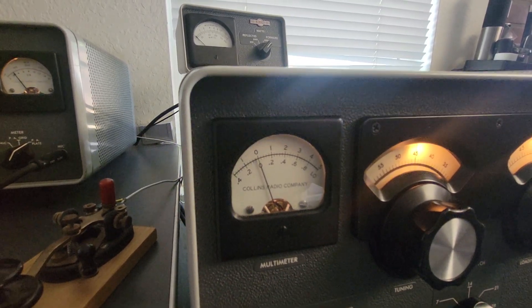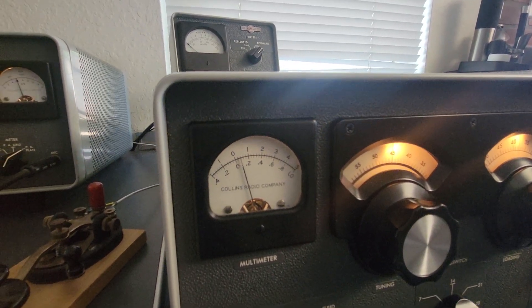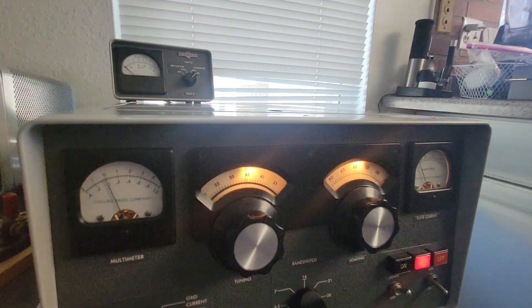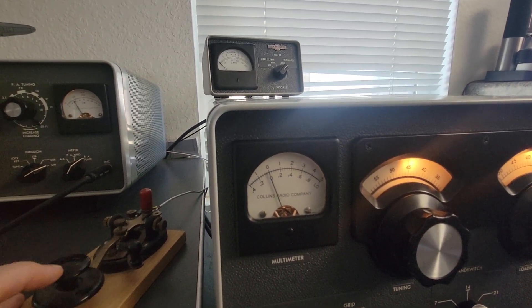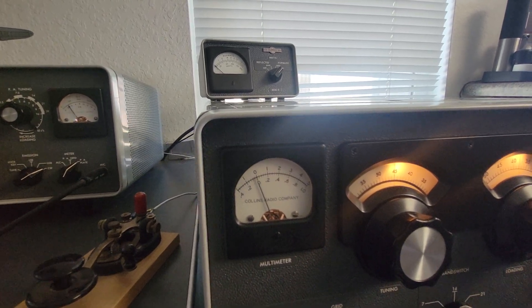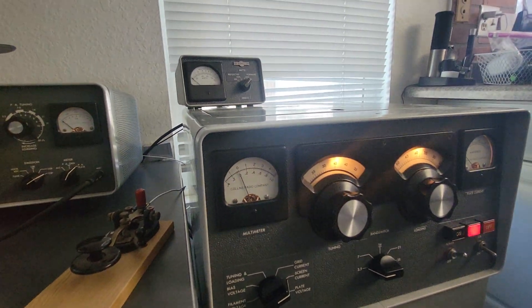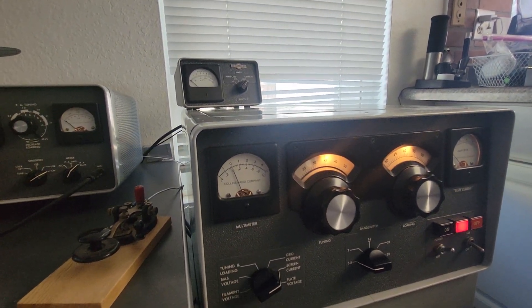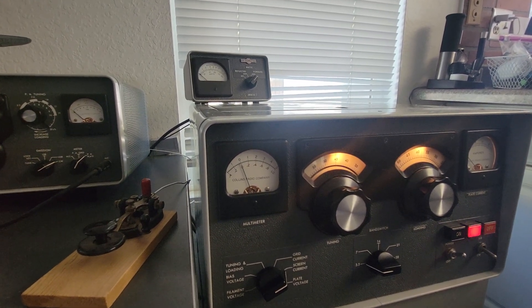You've got a 25-watt grid rating, and this is a 1500 tube in here, but that's normal operation. You can see the plate current meter go as I tap on the key — that's perfectly fine. CW here at 800-something watts. Go ahead and unkey it. That's how you should tune this amplifier — it will run literally forever if you tune it up that way.